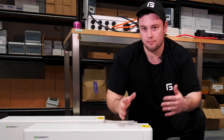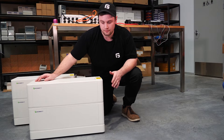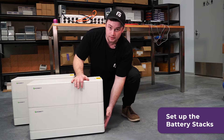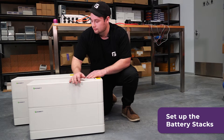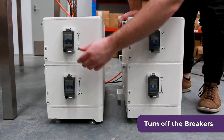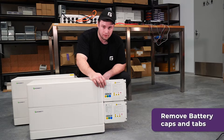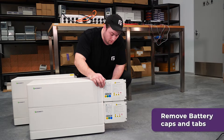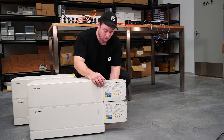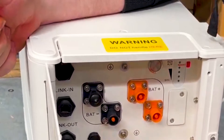With each battery box comes its wiring. The absolute first thing you need to do is set up the battery stack — stack it all on top of a base. Next, make sure the breakers at the back of each battery are turned off. Then take all the battery caps off the power terminals, and take out all the tabs between the batteries. You can also take the top one off depending on how you're going to route it.